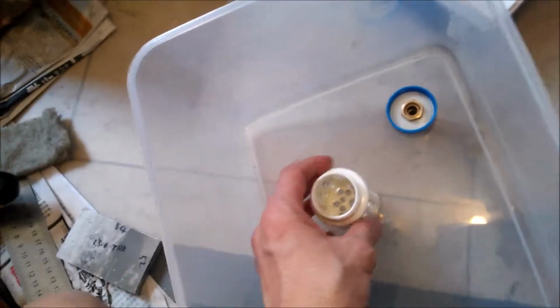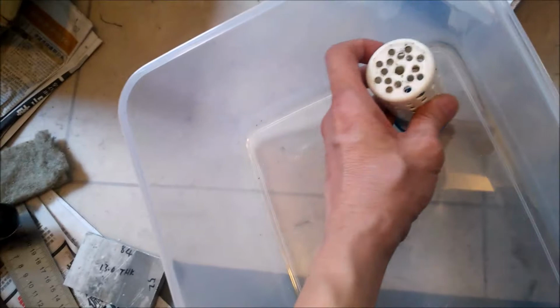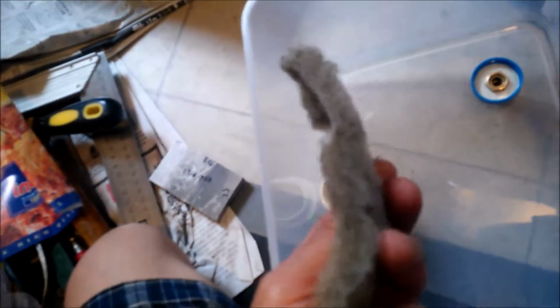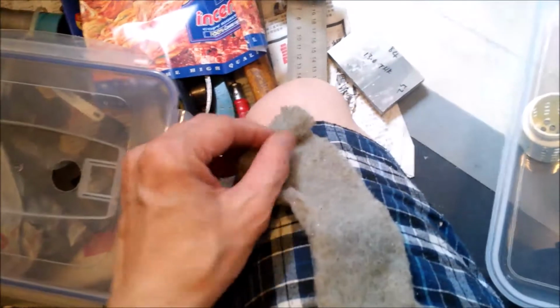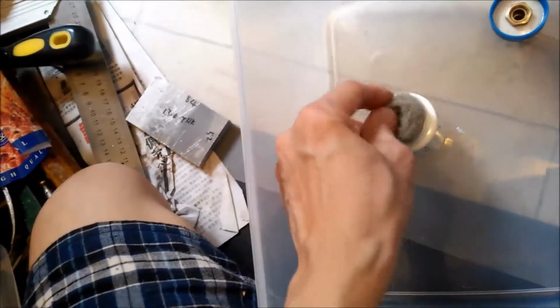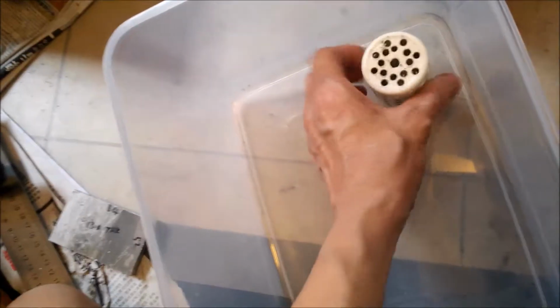And what is the purpose of this? The coolant will be at this level, and before going into the pipes and to the pumps, I need the coolant 100% clean. So this is the filter. I will put on this filter. This was already used, so it's dark in color. I will roll it into a small size and put it inside here. And then turn it onto the cover.